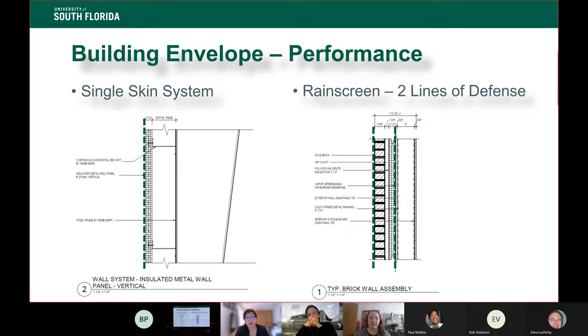You put on the straps, you've got all the stuff behind it. This is your standard architectural system. However, it doesn't move very well. And in our case, for the pre-engineered metal building, those buildings move a lot. There's a lot of flex and sway for a building with that big of a span. It's also not a museum or a hospital or even a classroom. We have a higher threshold of tolerance for changes in temperature and for the way that building is built.